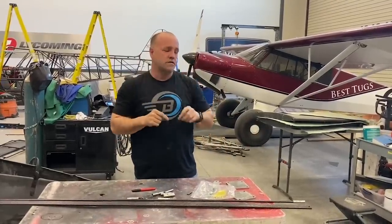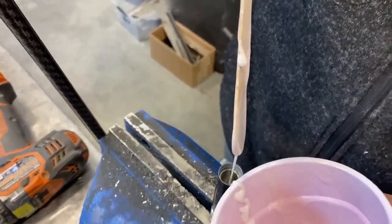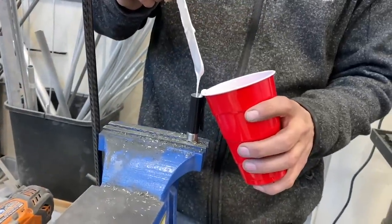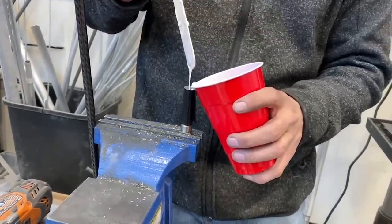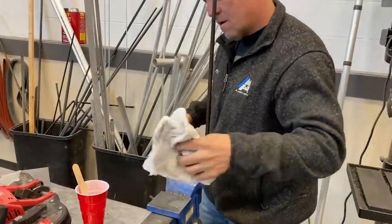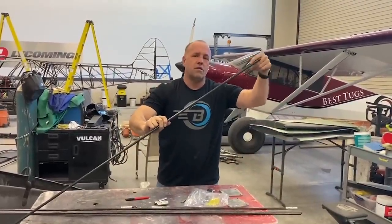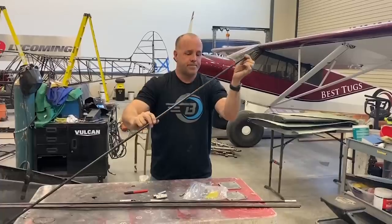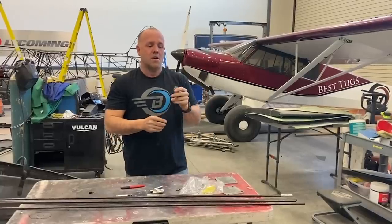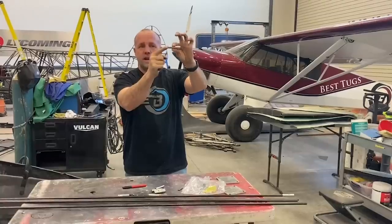So I've got these grooves, and I'll actually pour resin inside this tube, and it won't just be resin, it'll be micro bubbles with resin blended to a runny paste. That way it still is light, but I can literally pour it. So I'll wrap duct tape around, block all the holes for the rivets, fill this tube, put a fiberglass wrap, single layer over the end of the carbon fiber to put a fiberglass barrier between the carbon and the metal. Plus that fiberglass will only barely touch the sharpest point of the inside of the threads inside this.